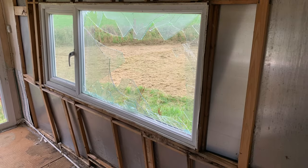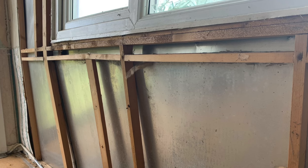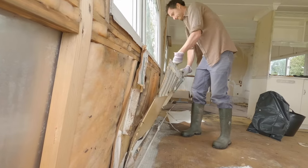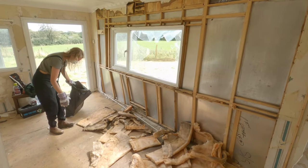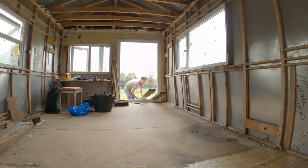There was a wall — this wall here — that was completely caved in. I think if we hadn't intervened and it was left another winter it would have completely collapsed, because on a windy day you could see those walls moving. The point we realized it was dangerous was when a friend came around and said we couldn't keep tearing down walls or the whole thing would come down. We were naively making it weaker and weaker — the hardboard isn't just aesthetic, it also contributes to structural integrity.